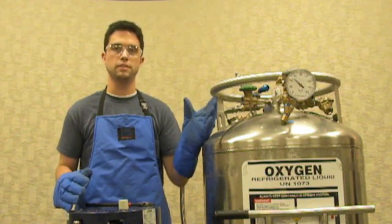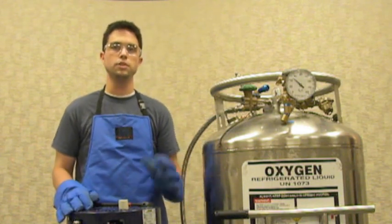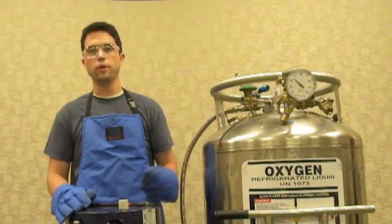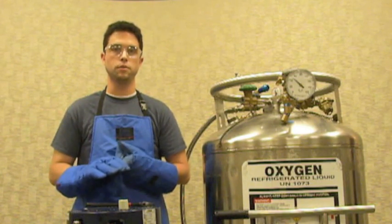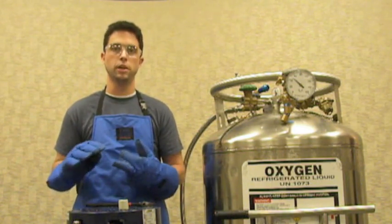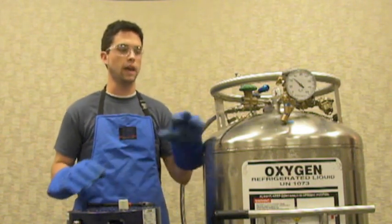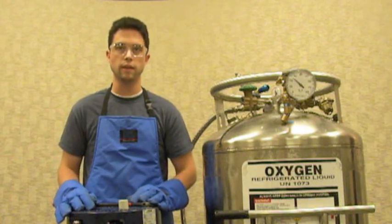In other words, the relief valve on this tank is set to 50 psi. So once you have your source between 35 and 50 psi, remember — no regulators to regulate the flow down. It needs to be direct from the source. Also make sure that you do not vent any pressure off. The actual storage pressure needs to be between 35 and 50 psi.